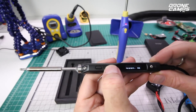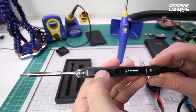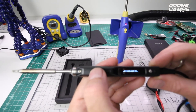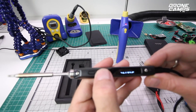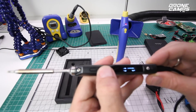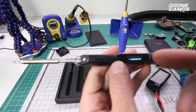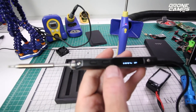If you press this button right here, it'll let you adjust the temperature range, and then use these two buttons to go up or down. It does it in 10-degree increments — pretty nice. I'm going to leave this on 400 degrees Celsius because that's about the minimum that I'm going to use for field soldering. And if you leave it for just a second, it'll go back to the main menu and start heating back up.